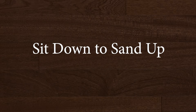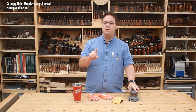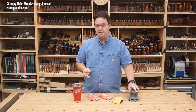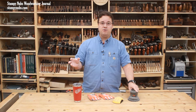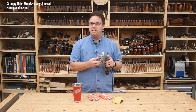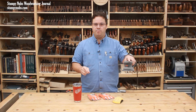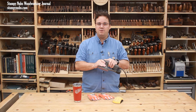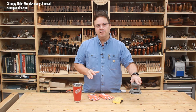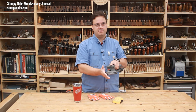It's a bad idea to start your sander in the air before you set it down on the workpiece, and I say that knowing that I myself do this all the time. Many lower-end sanders need resistance to keep them from spinning up too quickly and potentially damaging their bearings. But the biggest problem — even with a high-quality sander — is that when you do set it down, you can do so unevenly and end up putting a deep scratch in the surface of the project with the edge of the disc.